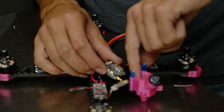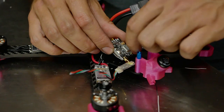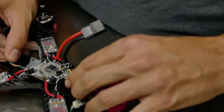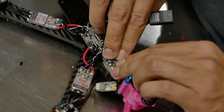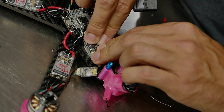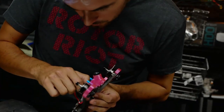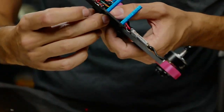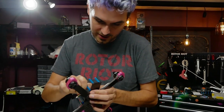I really like this video transmitter — the solder pads, the MMCX connector which is more durable than the smaller UF.L, an onboard microphone if you want audio, and an actual segmented LED display so you always know what channel you're on. Wires connected, I'll run them under the flight board. I'm using red double-sided body tape from the automotive store — it's very strong. Lining everything up, getting a clean bend on the antenna extension, making sure the video transmitter doesn't overlap the standoff holes, then pushing it down.